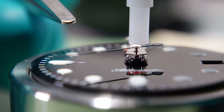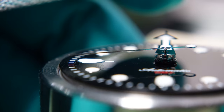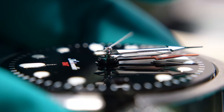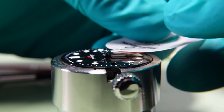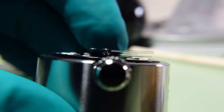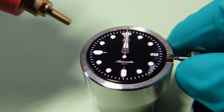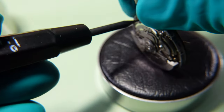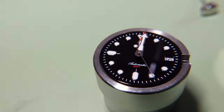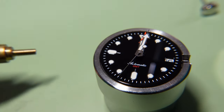The seconds hand is the hardest one — this was the third take. As soon as I think it's in, give it a quick check to make sure it's fully seated. But I've got an issue with interference: the minute hand and seconds hand are a bit too close, and the minute hand is slightly bent up. Using the Bergeon Dial Protector, just very gently putting a slight bend to open up some clearance. That's looking much better now — we won't have any hands touching as they go around. Lots of cleaning to do: dust and dirt still manages to end up everywhere, so plenty of work with the blower and Rodico before casing.